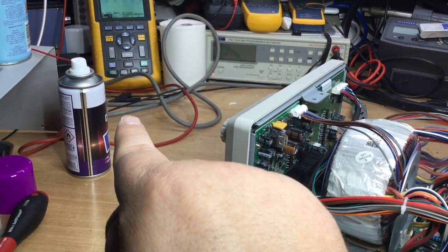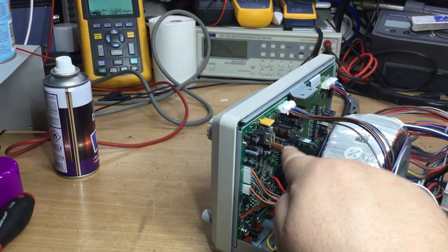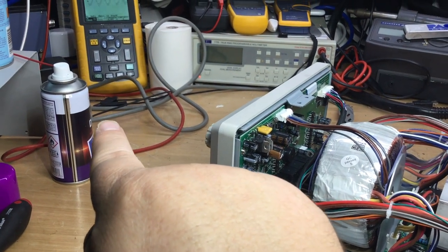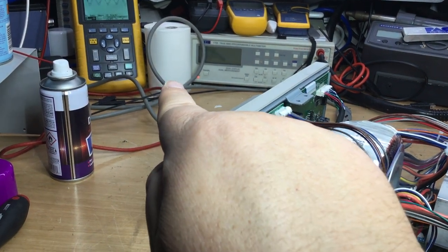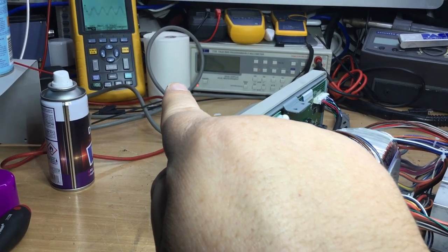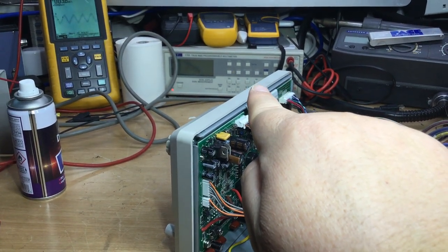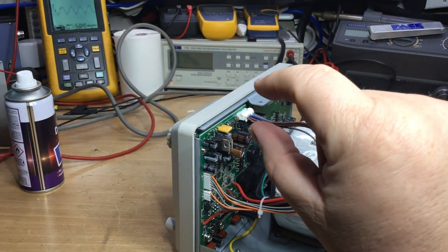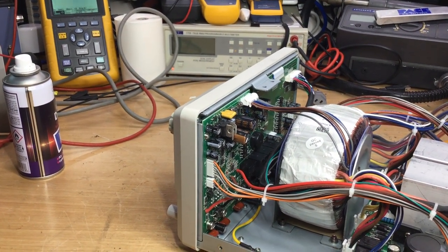On the peak of the AC cycle from the bridge rectifier, supplied via these smoothing capacitors to the input of these voltage regulators, DC regulators, you could see a sawtooth wave, where it ramps up to the peak of the signal, the AC waveform, and then it comes down and then ramps up again for the next half cycle of the AC waveform, and then ramps down again and up. And that level difference was 1.3 volts AC at 100 hertz.